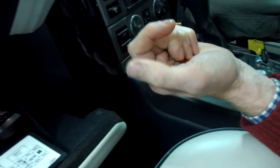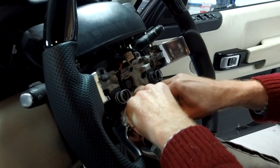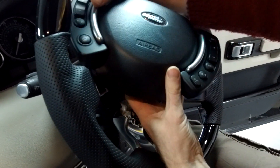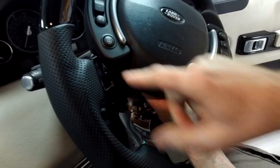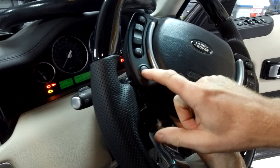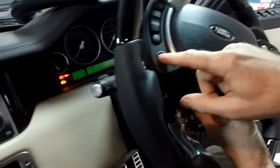If that bridge is broken, you're in trouble. If your fuse has gone, your steering wheel won't light up at all. Let's have a look - I don't believe it will light up at all. So let me just connect this. Careful with your airbag - there's your heated button. Put your ignition on, make sure your lights are coming on your dash. Sure enough, without the fuse in, it doesn't do a lot.